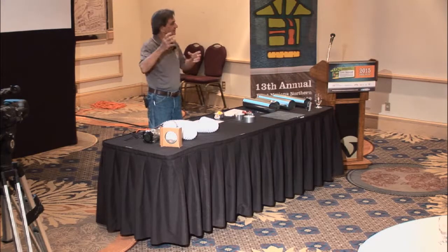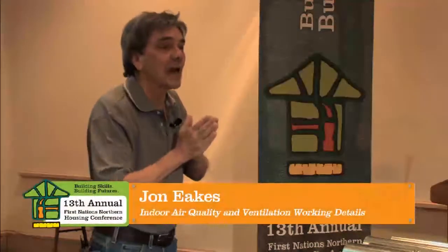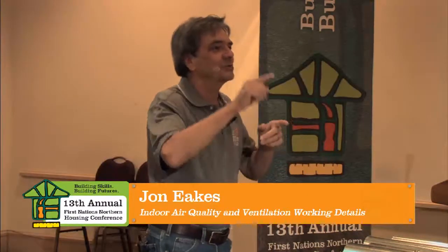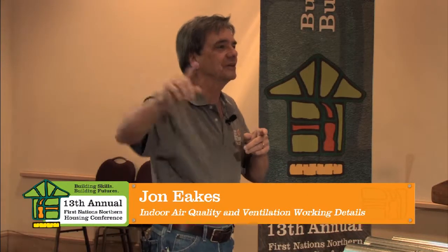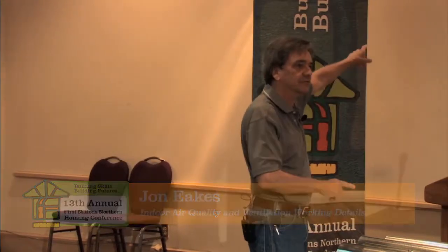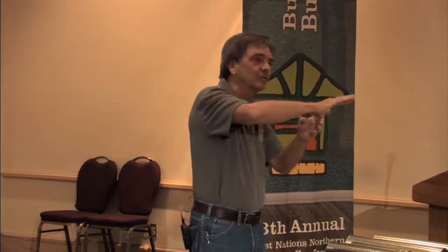The fan spun, it made noise, but there was 0 coming out the other end because this snake, sort of like this Chinese dragon snake running through the attic, had so much resistance that that tiny little fan couldn't push anything out the other side, or at least couldn't open the damper to let the air out, because the damper itself gave some resistance. So when you add that all together, it came out that half of those bathroom fans were doing 0. So they had a fan, they had the noise, nothing was going on. And you wonder why you had the humidity.